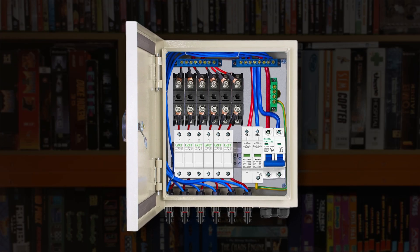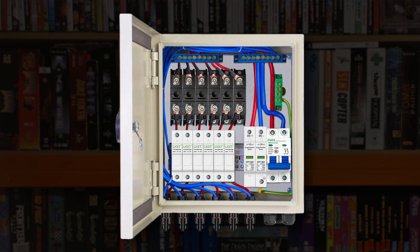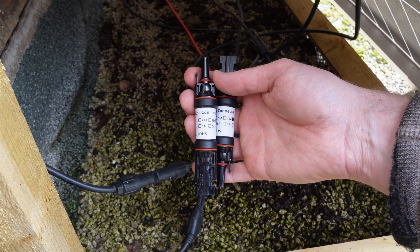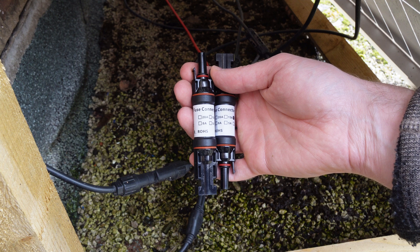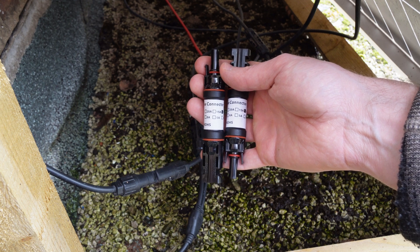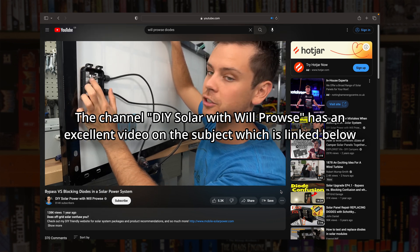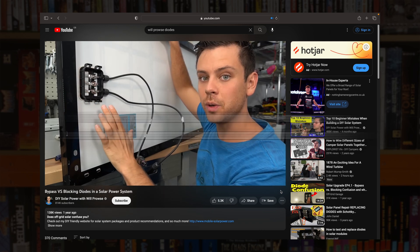I'd like to upgrade this wiring and fit a solar combiner, which is a box with built-in circuit breakers and a switch to isolate the panels, and it's probably something I'll do as summer approaches. For now I have 10A inline fuses on each panel, which will protect them and the wiring in the event of a short circuit. If one panel failed to a dead short, theoretically the other three could all feed into it and blow something up, which the fuse will prevent. These don't have blocking diodes, because there's not much chance of any individual panel being shaded apart from very briefly first thing in the morning, but the panels do have built-in bypass diodes. I'll link some more info on that down below if you're interested. Now is a good point to make it very clear that I'm far from an expert in all this — this is just a tour of my own setup, so please do your own research if you're looking to design a similar system for your own purposes.